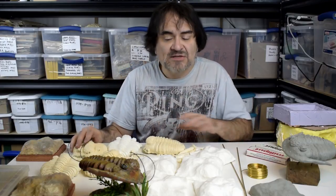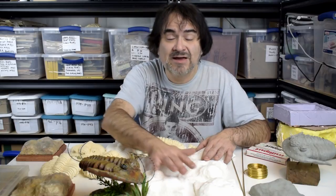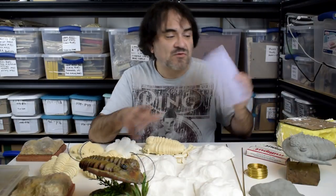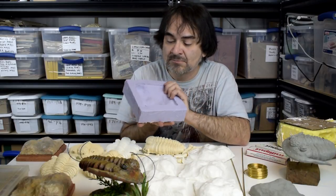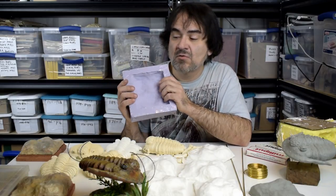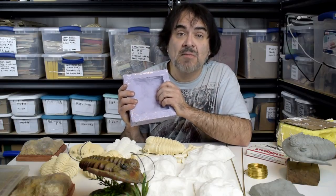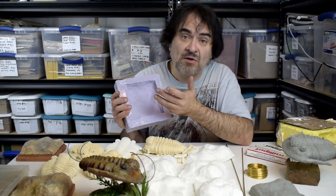Anyway, that's really all there was to doing this. You have to have some basic skills and knowledge. The casting part is simple — you can cast anything really easily and quickly with the modern-day rubber molding stuff. This thing will last me for a long time; I'll get hundreds of copies out of this one mold. If you want to make more and the mold gets bad, I always save the first casting — or whichever one comes out best — as my model. From that point on, I can cast a copy from a plastic piece and make as many as I want.